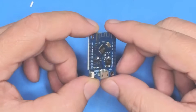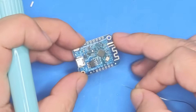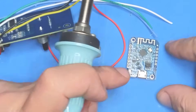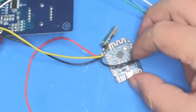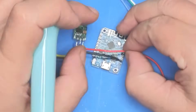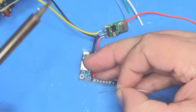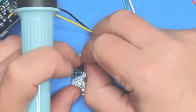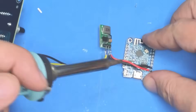Now we're going to connect all these wires to our D1 Mini. I'm using the V3 here - V2 will work just as well. I need five volts and ground. I'll tin those two pins, collect up our zero volts, then run the five volts coming off this regulator through - pulling it to get the right length, cutting it off, tinning it, and putting it on the five volt pin, making a little angle so the wire is above the board but the exposed wire is low down. That's the supply in.